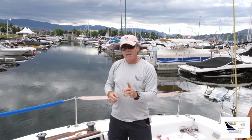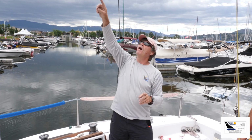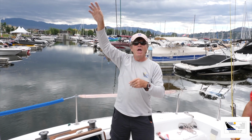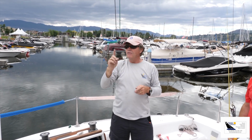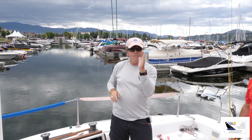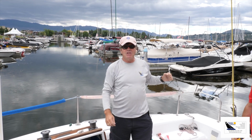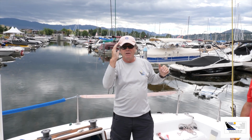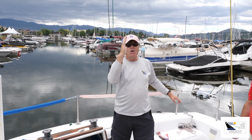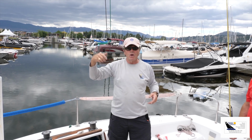And then the trick is you replicate that bottom, medium, top, which is difficult when you only have one set to play with, half of the bend that you find on the sail. If you do it halfway, then when it's blowing, you pull the backstay on and it flattens right out. And when you let the backstay off, it comes back to halfway. Because if you go all the way, you end up knuckle forward on your sail.